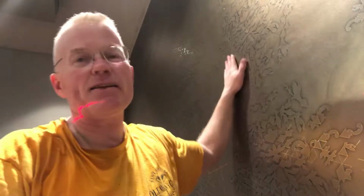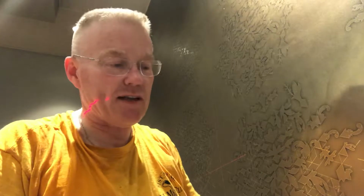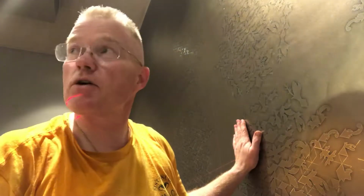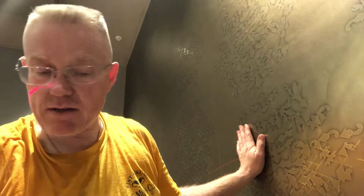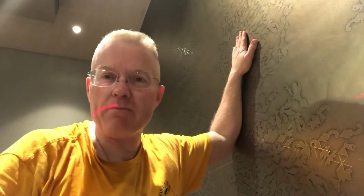Hang wallpaper. It's beautiful stuff. I mean, you couldn't get this design anywhere. It would take forever to paint it. All they do is stick it through a laser printer, and they put this solvent in it. By the way, don't be hanging paper with latex print. It's garbage. You want solvent because it's embedded in the fabric.